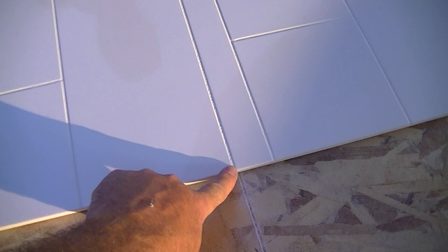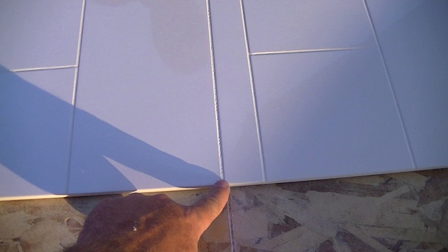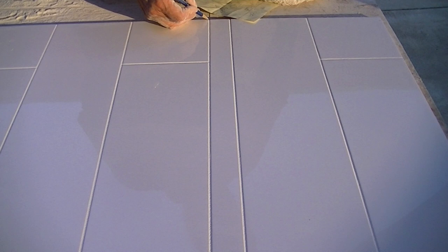From that pencil line in the shower, you measure from here down and the other side down. We cut some off the bottom so that levels it on the pan. Then I'm going to come and measure from here up off of my control line after I rip my side down, then I'll cut my top.